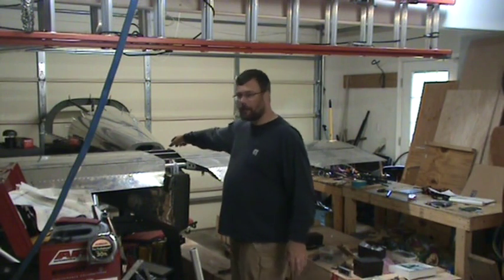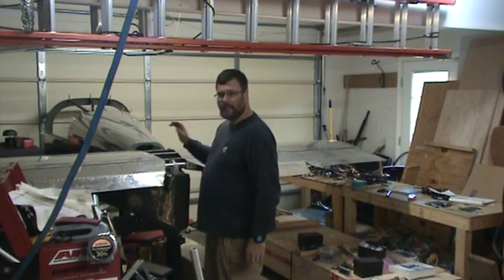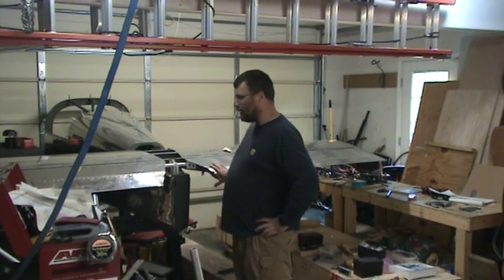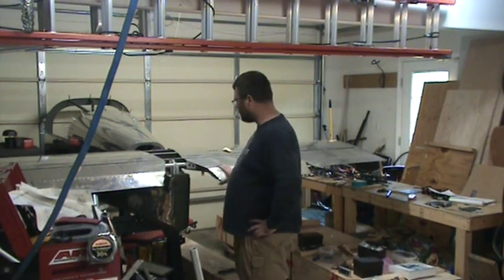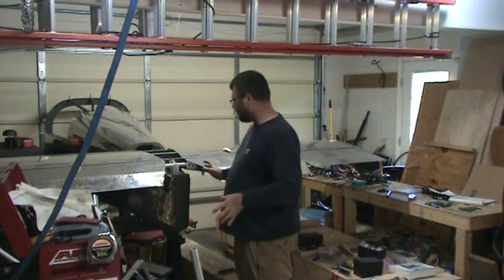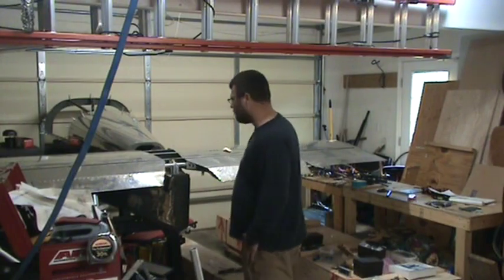which I think my error in adjustment is up here on the cam, the clevis that goes to the cam, so I need to adjust that. And then I will adjust the plates, check the movement to see if this one stops in trail position and doesn't go above. You don't want it to really go above. You definitely don't want them split, one above, one below. So I'll try the book method, and if that doesn't work, I'll do this side and then adjust this side to match, basically.